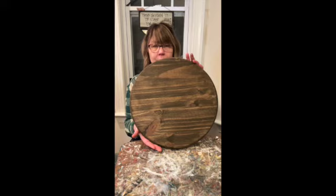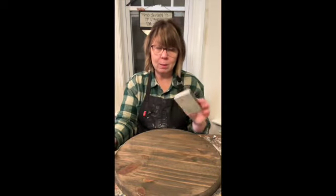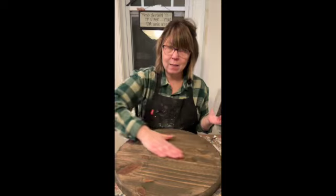And that's it — that's your first step. You're going to let this sit and dry in a place where it can dry. Love this color — dark walnut. I'm going to let this sit and dry overnight. I'm going to check this in the morning because sometimes when you do stain on real wood like this, it can get bumpy — it can raise the grain. What I'm going to do if that happens is take my sanding block and go very lightly with the grain and sand it. If I have to do that, I'll video it.